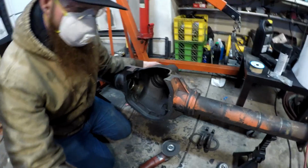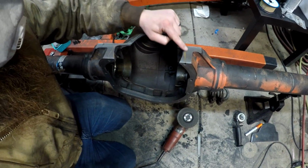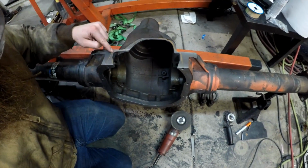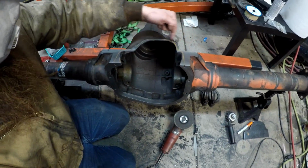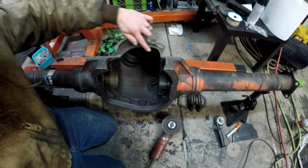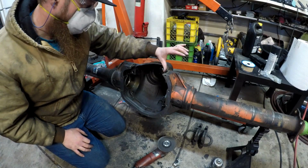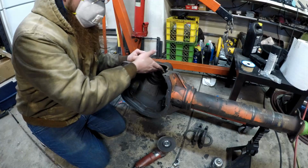I don't know if you can see this orange line I've got on top that kind of traces where the plate goes, and of course I'm tracing on the outside, so I'm already really close to blowing through if I just do a hot weld to start the party. I don't really want to cut back any more than that. I've got close to 1/8, so I can weld that. It doesn't have to be hot, but I just don't want it to burn way back when I'm welding on it and cause issues.